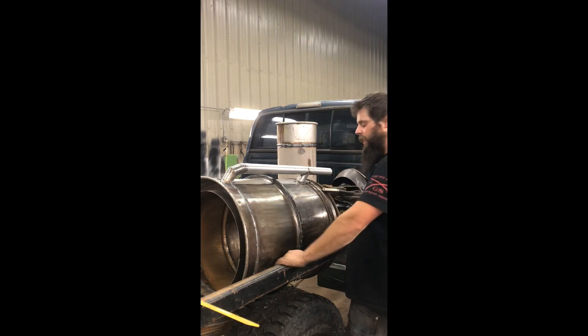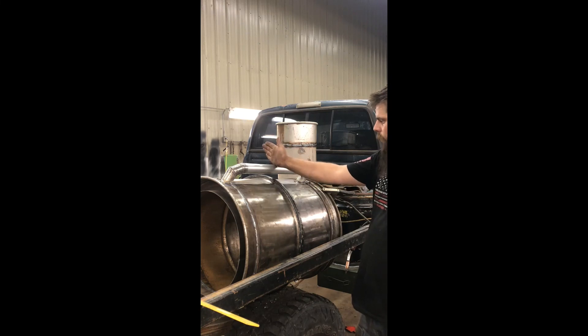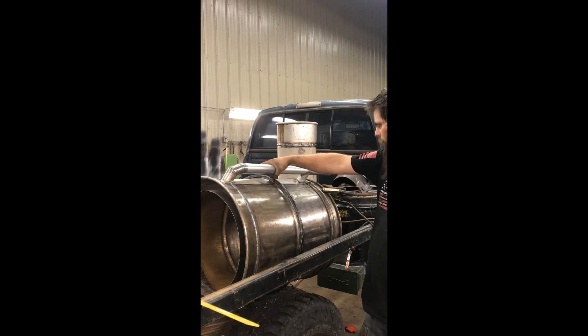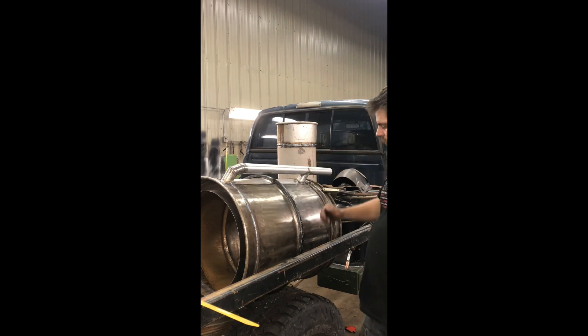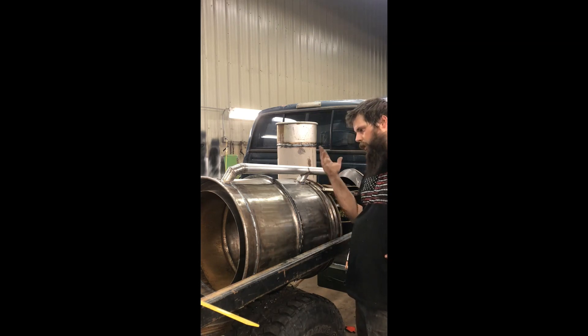I did have a barrel lid clamped on when I welded the top. I don't worry about it down here because I'm above the bottom of the barrel — it doesn't distort that much. That was several hours of work. And now I get to cut it apart — because, you know, two-piece hopper. So it's going to get whacked right here. There's going to have to be a coupler in place right here, and then I'm also going to cut it off down here and weld the bottom of this down onto the spout down on the frame rail. And then tar drain is done.